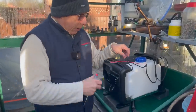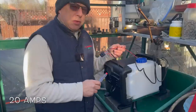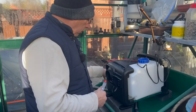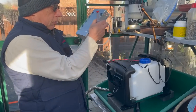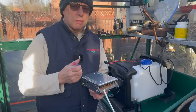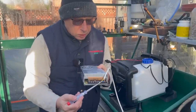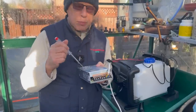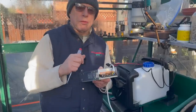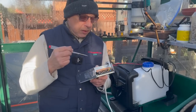Next is the power supply. The unit comes with a power lead that has an inline fuse. There are different ways to power it - a leisure battery, solar trickle charge, or mains. I've chosen a mains transformer, around 30 amps, because on startup the heater draws between 9 and 12 amps. The transformer has mains input with live, neutral and earth, and six banks of 12-volt output - three positive and three negative. After connecting the heater, you'll still have two 12-volt outputs spare, which could be used to run LED lights.